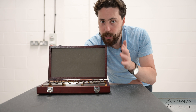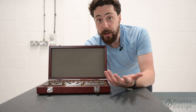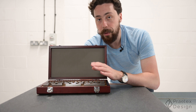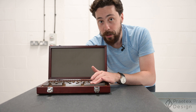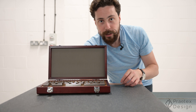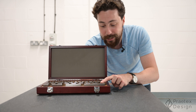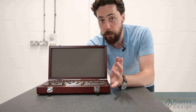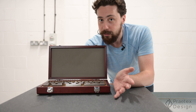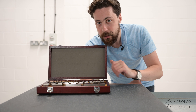This allows you to do things like calibrate your measuring tools. The issue with any measuring tools, especially electronic ones, is that they can go out of spec. So you need to be able to confirm that all your measuring tools are properly within spec, and you do so by using things such as gauge blocks. This is great in both the CNC — where you've maybe got a Renishaw probe or a height gauge — or in my case a very cool thing I'm not going to tell you about yet. Or essentially just things like your calipers, micrometers and so on. You want to know that they're actually measuring values correctly — otherwise, how will you ever know if you're hitting a tolerance? In a machine shop, these things are absolutely essential.